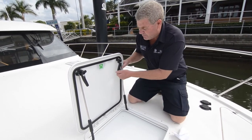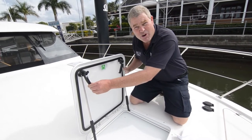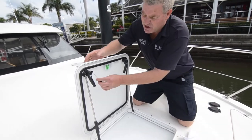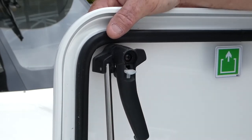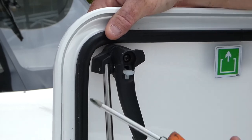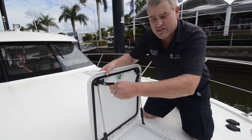The next thing is to check your handles. It's very important that they're nice and tight and firm. That one's good, but this one has come a bit loose — the most common reason for hatches to leak. So I'm going to tighten it, which involves removing this little cap here to reveal a screw underneath. Just put your Phillips head screwdriver in there, give it a few turns, and you can feel that's nice and tight now — no chance of any leaks.